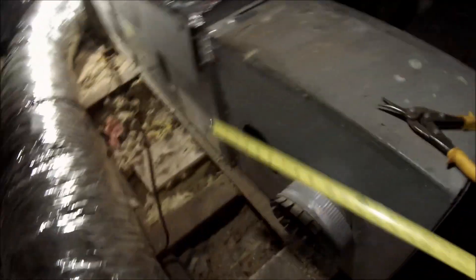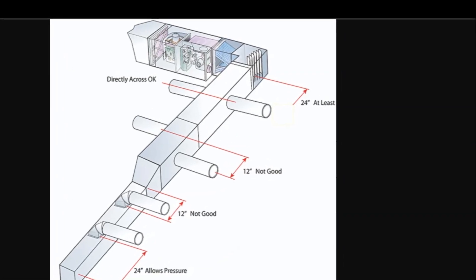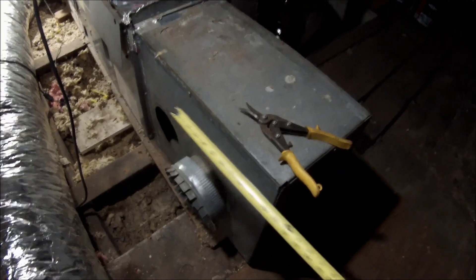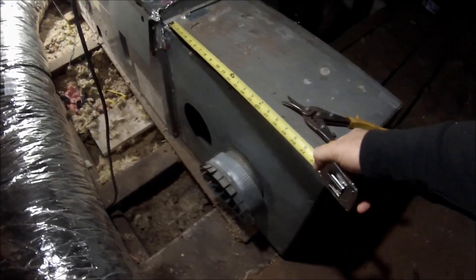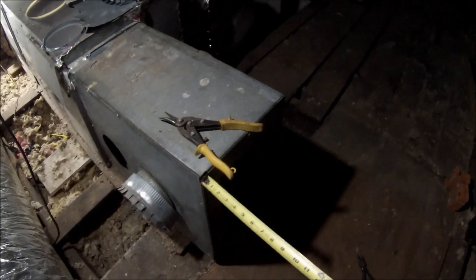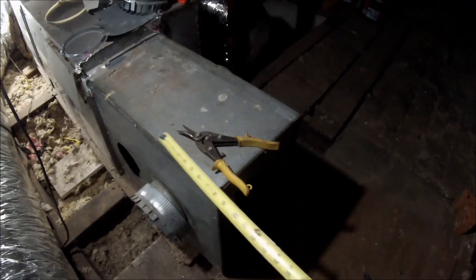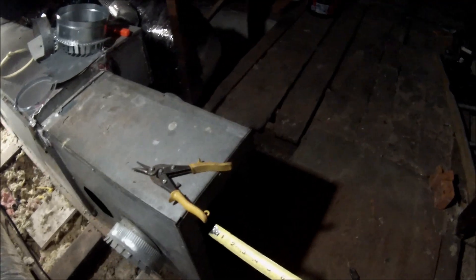From what I read, you want to have at least 24 inches away from the handler — the 24-inch rule — so that pressure builds up and no outlets come off within that 24 inches. This box should really be way out further, so I might have to make another box this size, add it where it's at, and then push this one back two feet.